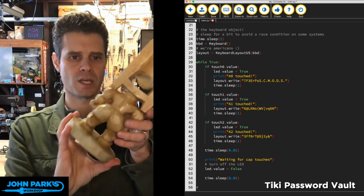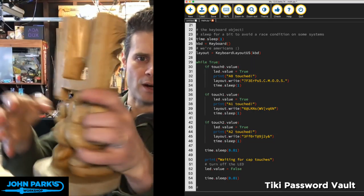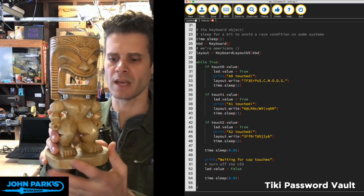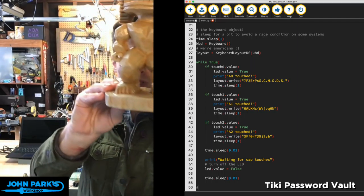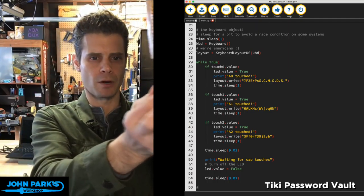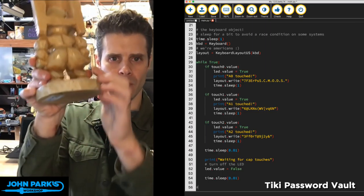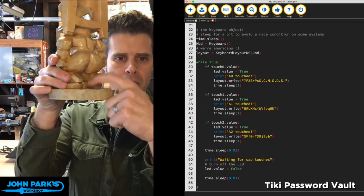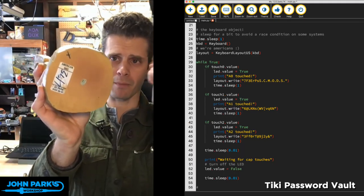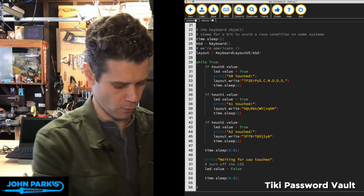So I was thinking maybe one inside of the roof of his mouth there. If this is how he's sitting, you would kind of reach up and touch in there. We can put a piece of copper tape in there. And he's got these little holes in his hands, though I don't know what this guy's original purpose was in life. So I was thinking of putting a couple little metal rods inside of there, and then we can touch those to trigger it. Then we can run some wires down, and I was thinking of drilling out a hole in the base here and embedding the Gemma in the bottom there by cutting a hole. So let's go make some dust. That's what I got for a plan here.